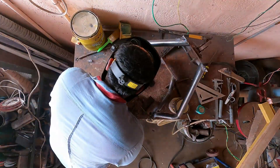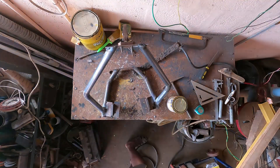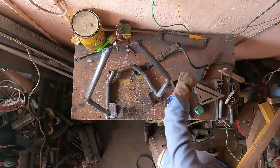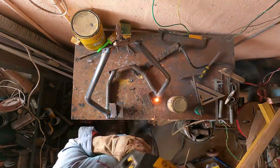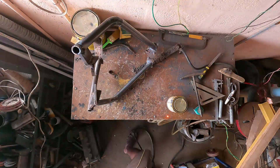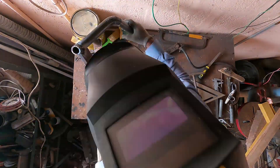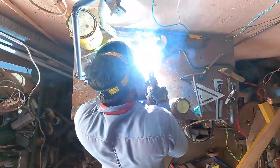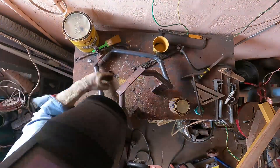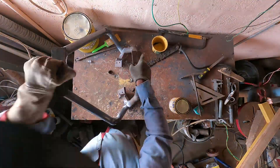This effect doesn't really come into play when you are designing a trailer for a stable four-wheeled vehicle, but it changes when you are towing something using a two-wheeler that is already an unstable vehicle being balanced by someone. I designed the trailer so that most of the load is on the axles of the trailer rather than on the bike, but I found later that you need some load on the actual hitching point for the trailer to be stable. So this subframe is designed to take at least 50 kg of load, and I feel confident about its strength.